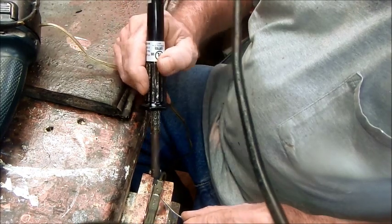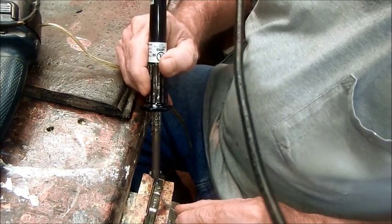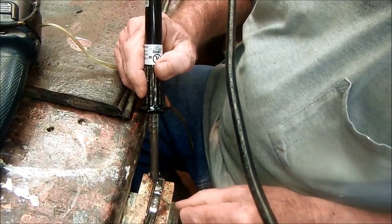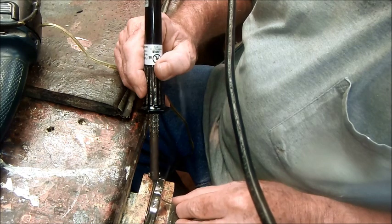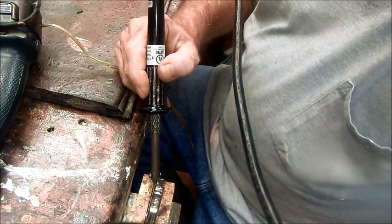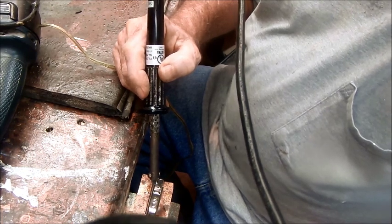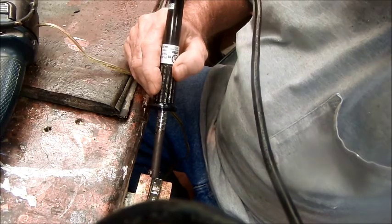You don't have to tell me in the comments that you're a better solderer than I am — you're not aiming high enough. What I do when I'm soldering is I'll sometimes melt a little ball of solder and keep my iron in it. Then once the metal below it reaches the correct temperature, there'll be kind of a phase change — the color of it will change.